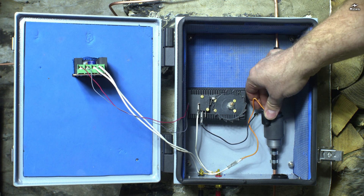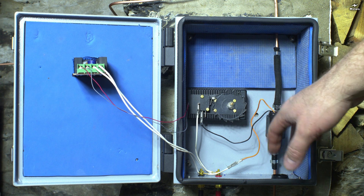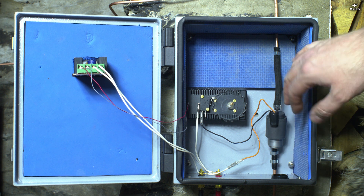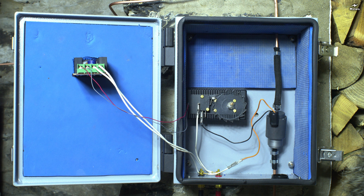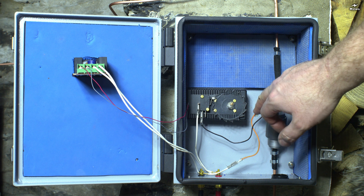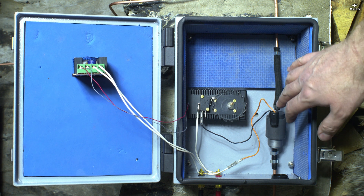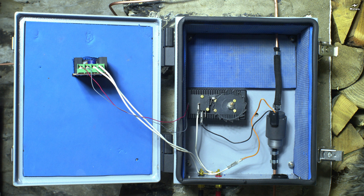This particular pump is not like a normal fuel pump that you apply power to and then it just continuously moves fuel through. This is the kind of pump you get on a diesel parking heater, like an Eberspacher or a Webasto, or one of the many Chinese copies of those things. They work on pulses, so it's called a dosing pump. Every time a pulse of current runs down the wire in either polarity, the pump will send a predetermined amount of fuel up the line — really only a few raindrops worth. So the more often the pump receives an electrical pulse, the more fuel gets delivered to the stove.